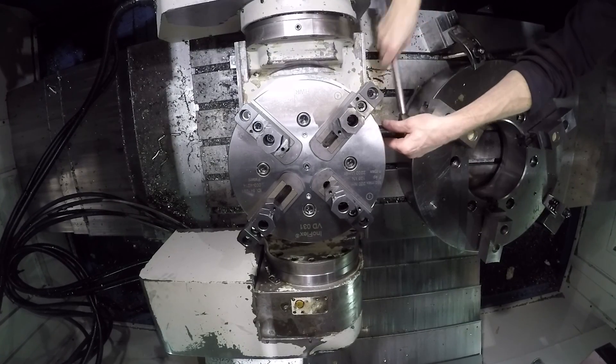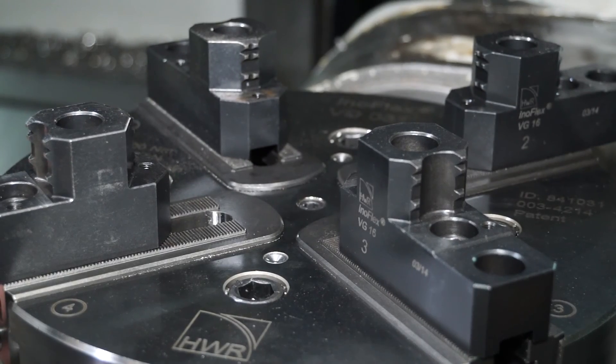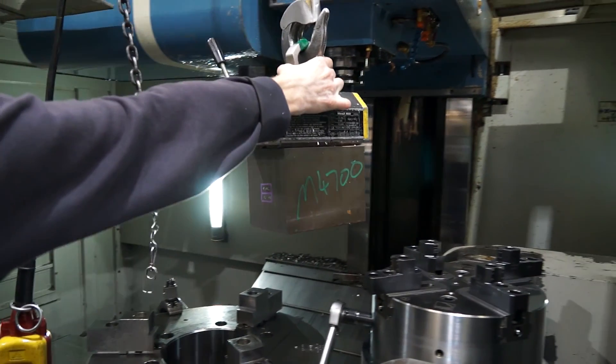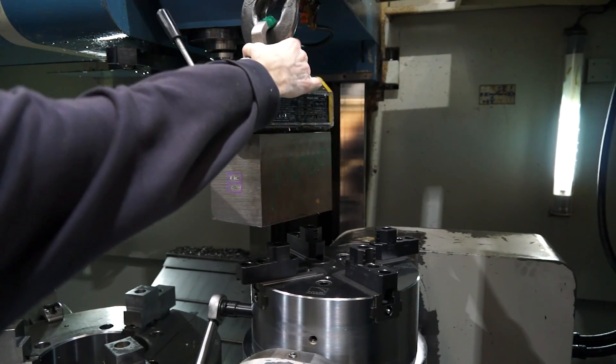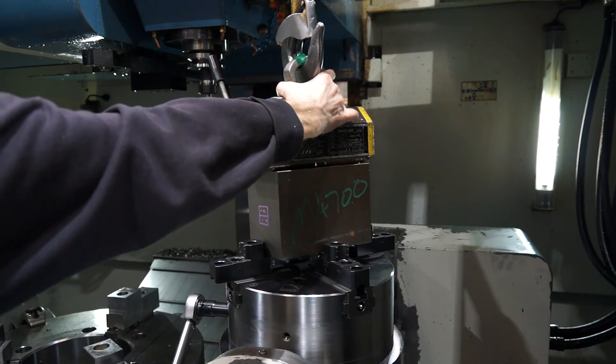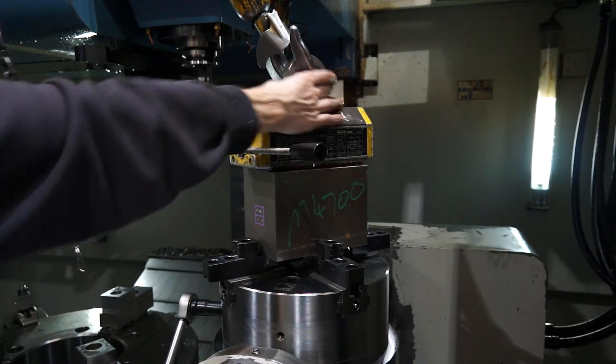And presumably you can use this for just normal machining — if you did have a radial part, you can still use this system? Yes, we use it for all sorts of different things. What it's also meant is that we don't have to swap between a four-jaw chuck and a three-jaw chuck for conventional round components. We've also used it for other parts recently where we've had to diversify our work — to hold rectangles, hexagons, all sorts of different shaped parts. So it's been very helpful to us.